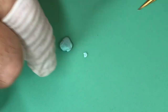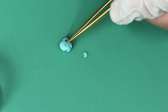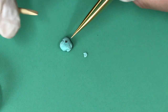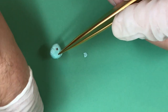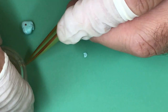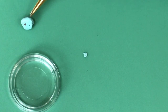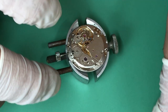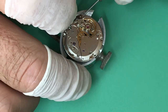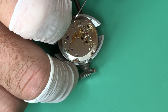Then I've got a little piece of Rodico that I just keep that screw in, because I just put it in that little thing, and I'll put the balance in a separate compartment. Like I said, I don't like using that balance tack; it just gives me the heebie-jeebies. So I'll put that in there. But at first, I've got the screw and that little bit of Rodico, so it doesn't go walkabouts. And then what you do is, and this should all come apart pretty simply because I've had it apart recently, you just take the screwdriver and get under it, where the posts are,